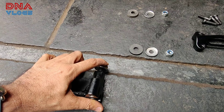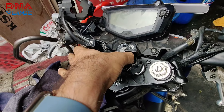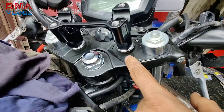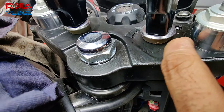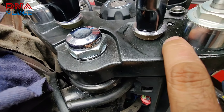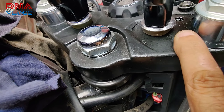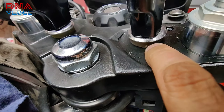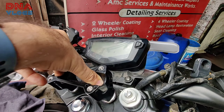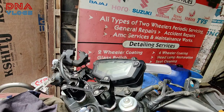This silicon washer is also going to help balance this edge. This edge is our whole handle and flat surface — I have not touched this surface because if I have a whole handle on it, I can straight away fit it on this thing. Otherwise, ideally it would be good to flatten it out, but we don't need to do that. Put the silicon washers and rubber washers in the back, and your assembly should be ready to be installed. We need to open this to tighten the front because we don't have access to the bolts from here.